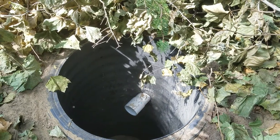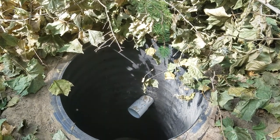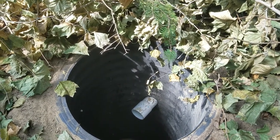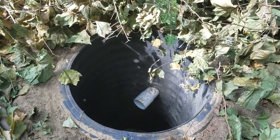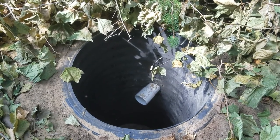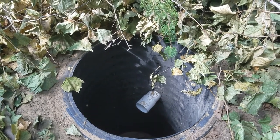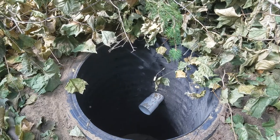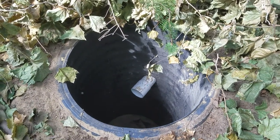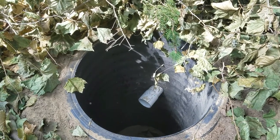For sizing dry wells — if you have poor soil percolation, you need a bigger reservoir. You can just dig a hole in your yard and fill it up with water. If the water drains away, you've got amazing soil percolation and you won't need anything more than what you see here — actually, this is probably a little overkill. Everything we do, we overbuild just to make sure we cover the homeowner and ourselves. But if you fill that hole and it fills up with no percolation, and you come back the next day and it's still holding water, a dry well is not going to work for you. You're going to have to take additional measures to evacuate that water from your yard.